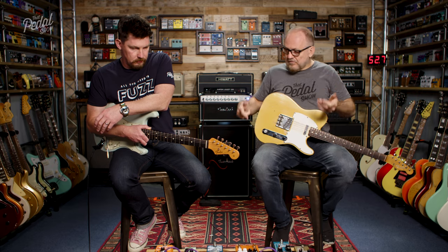It's an input driver that replaces a conventional buffer to protect and condition your instrument signal and prepare it for whatever you want to do with it. Console-grade build, which probably means it's hand wired. Well, it looks a little bit like a console. One thing that does make me laugh, the power supply jack is called Whatevs, which means you just plug whatever you want in there and it'll work. Which I quite like. An elite unity amplifier. It takes 7.5 to 35 volts of AC or DC power.